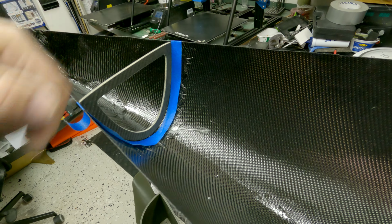So this is a report. It's Sunday night and we have tomorrow off, so that feels good. This is Kookaburra IV, so 4 ring frames installed and the stern installed. I'm quite pleased with this new design of the ring frames, where I use one layer of carbon and divinycell core and one layer of carbon. Turned out very strong and extremely light.